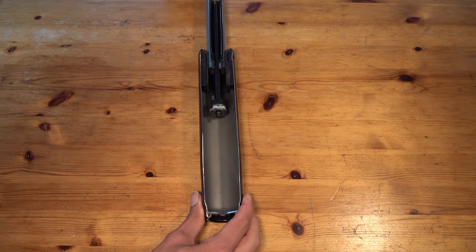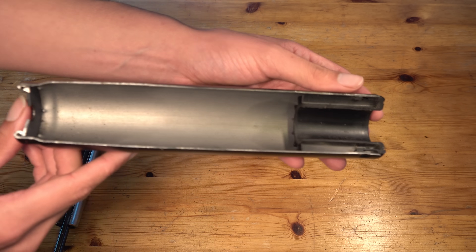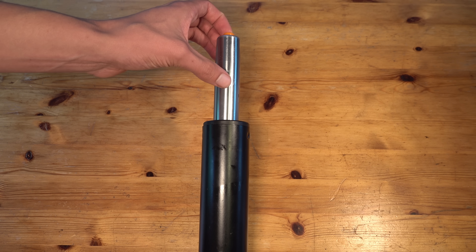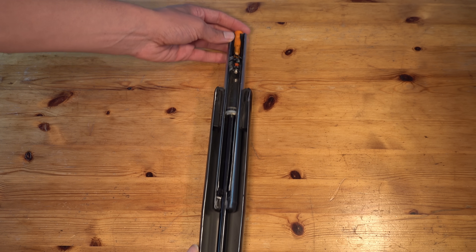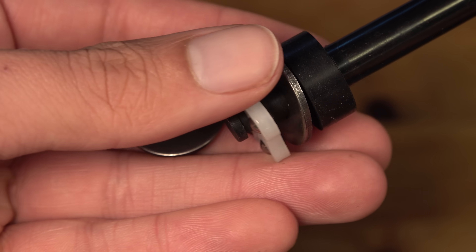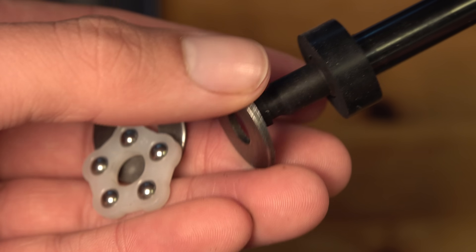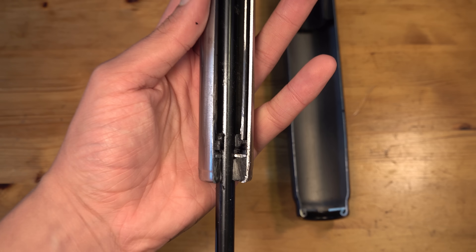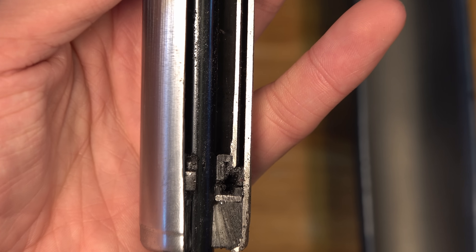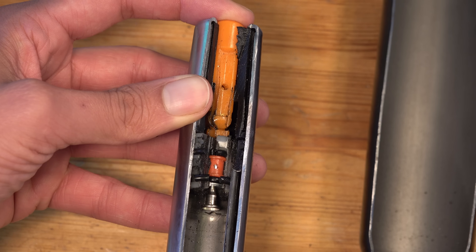So what do we see? The first thing that stands out is that what looks like this cylinder is actually just an empty shell. It holds no pressure and just keeps the actual cylinder upright, which looks like the piston rod. But the rod is actually down there, and it rests on a very simple pressure bearing - just two hardened steel washers with some bearing balls held in between with a piece of plastic. This is actually what keeps all your weight up. Inside the real cylinder we have an outer and an inner sleeve, the piston, and the valve that is operated by this orange piece of plastic, which is in turn operated by the handle of the chair.